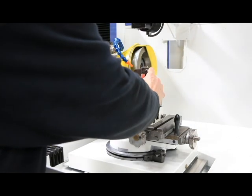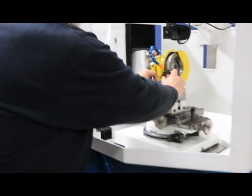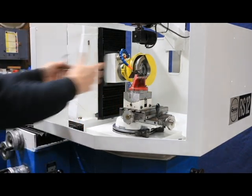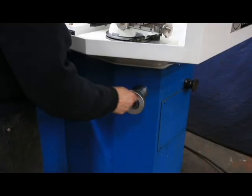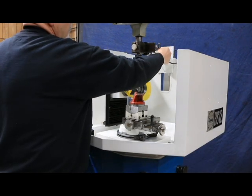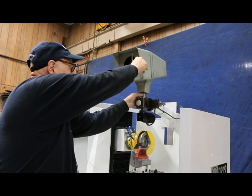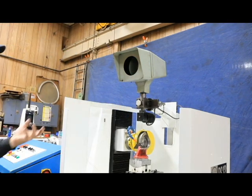This is a very expensive fixture, I'm sure — it's part of the machine, you can't really work without it. You just give this a little twist and it's locked, and a little twist and it's locked. And then you've got your four little feet that lock it into the dovetails. You can pull this out and move it over, move it out, move it back, move it forward. Over here you've got a control for bringing your light source and your inspection equipment down. You've got a slide here where you can make fine adjustments and move this light over. This is your fine focus — as you're watching your image in the window, you'll see it come into focus.